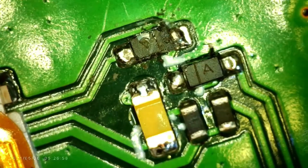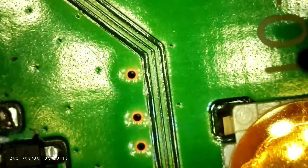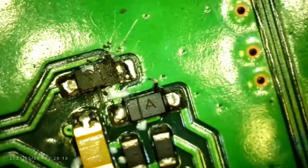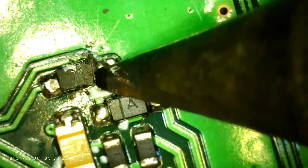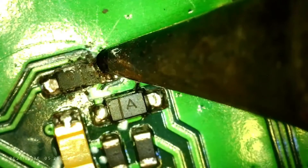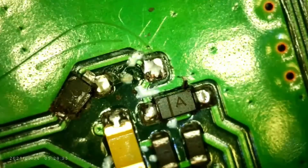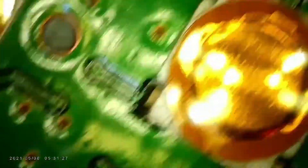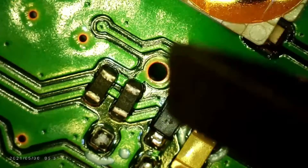I'm going to put the soldering iron back on the tip and try to push it off. Like I said, you cannot grab it — you can't even get a needle-nose and try to force it up. It's just tiny, super small. I'm going to try and put the soldering iron on it again, hit it real good. I don't want to overheat it because I don't want to mess up anything else. So I'm pushing it off — just heating it up and... there you go! Once one side is off, the other one comes out very easily. I've got a magnetic screwdriver. That's the upper one done.